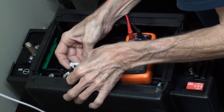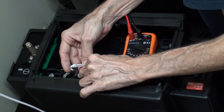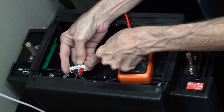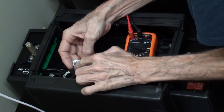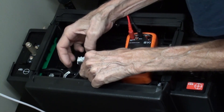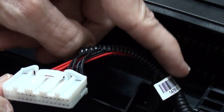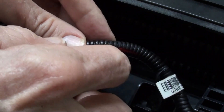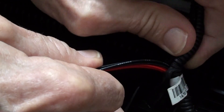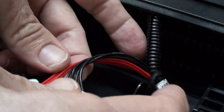These red wires: this first one at this end has no other one in the row behind, but after that they go front-back, front-back, front-back all the way to the negative end. I'm going to unwrap some of this wire protector to get more room to work with these wires. I've taken the tape off these wire looms — they're split once the tape is off, that's how the wires got in there — and I'm pulling it back so I can get good access to my wires.